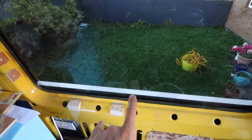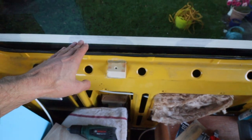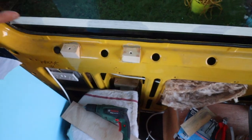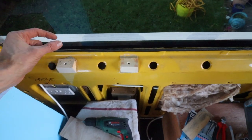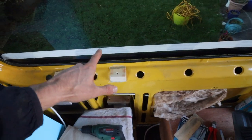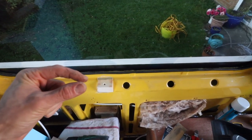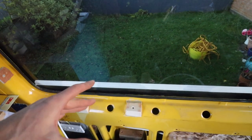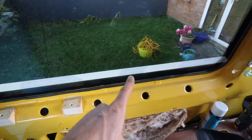Here's the window that is going to be framed, and this is masking tape running along here — that's the level of the countertop. Once I have the units put back in place and the framing is all in place, I will then cut the countertop up towards the window, leaving a couple of mil where I can fill that in with clear or white silicone. I don't want any wood touching the window, and I also want a gap for the wood to expand and contract without interfering with the window — that's the reason for this masking tape.